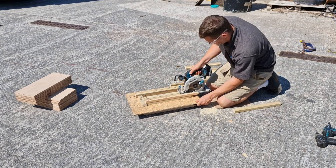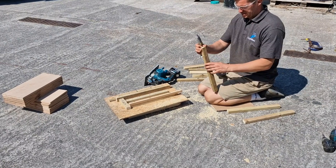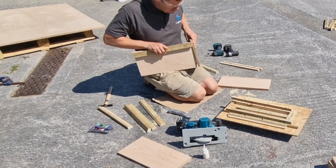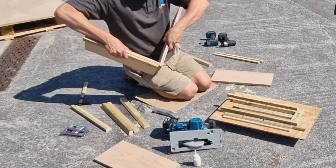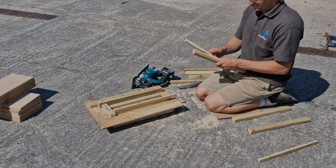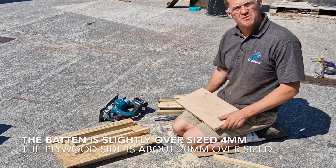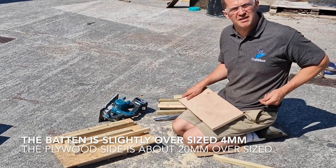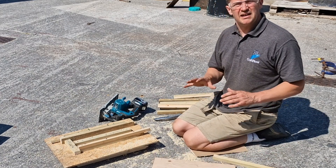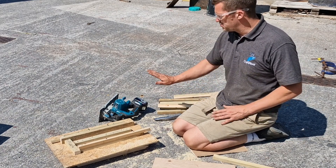After the second cut, remove the leftover piece of wood - this leaves you with the L-shaped frame bracket. It's really important to get your sizes and dimensions right. The most important thing is to make sure these frame bits match up exactly with the 18mm ply; if not, it leaves gaps along the edges. All of mine are oversized by 4mm so they can be cut down to exact size. If you were using a table saw you wouldn't need to do it this way, but with a circular saw I find it the easiest approach.